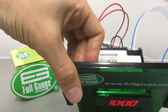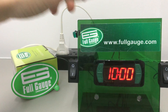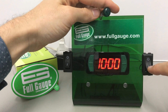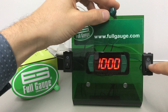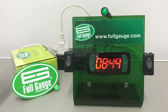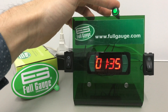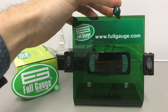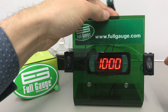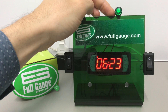It's set to 10 seconds. We have this key attached to the start/pause digital input. When you press it to start, this light should turn on — let's check it. The light is on! And when the timer finishes counting, it turns off. It works! So if I'd like to reset it and start again, I just need to open and close the contact again and it will start working.